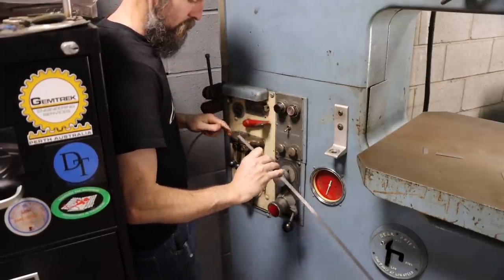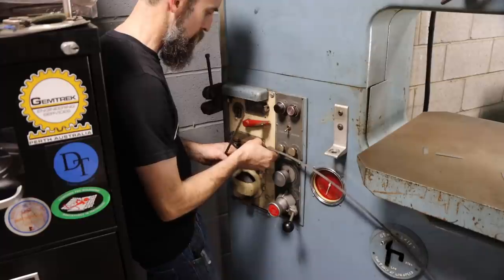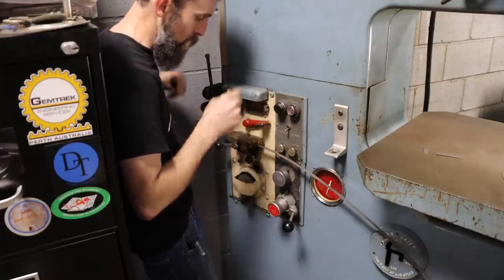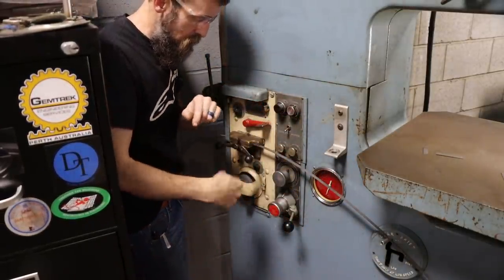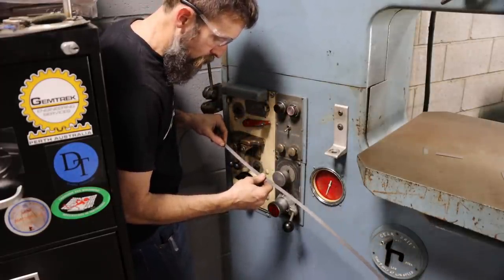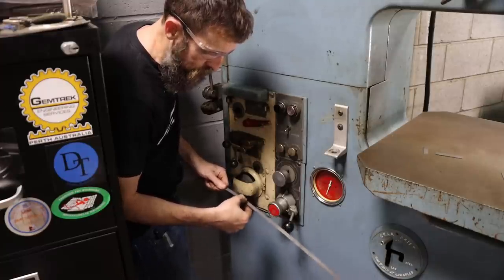you see, cut your blades and you put them inside the welder here. This is the old style, so there are more modern versions of this, but this does work. And once you've properly selected the size blade that you wanted to weld, you just push down on the handle. It pushes them together and welds them. And now we have a successfully welded bandsaw blade that I will now grind, because it does raise up some slag.